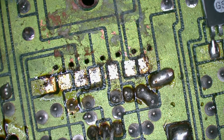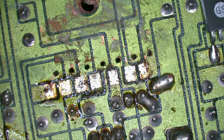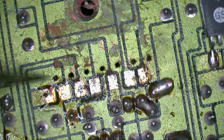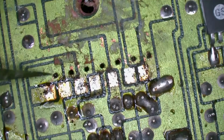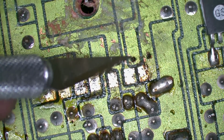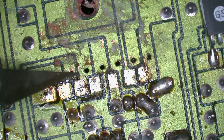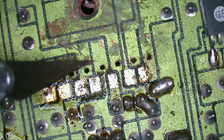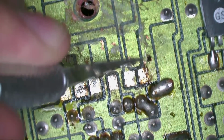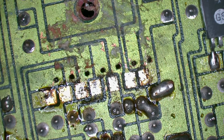Alright, so what I think I'm going to do here is put that driver pack or integrated amp back into the circuit. And we know that we have some via issues in these holes going to the other side. So what I'm going to end up doing is scraping all this off and soldering it from the back side with a very fine point soldering iron. Because the other side has no traces that go off anywhere, you solder it from that side and it's supposed to penetrate through and connect to these right here, which is not happening on certain pins. So I'm going to back solder it, and that should take care of that. I'm hoping that I can just scrape away at all this and expose some copper to solder it to, and we'll come back when we get that all prepped up.